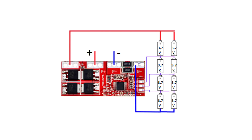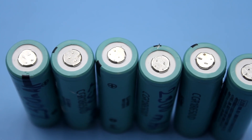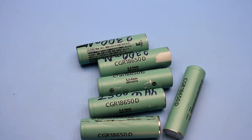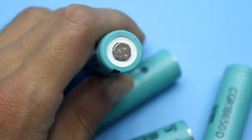In my case the battery is 14.8V, that is 4 cans connected in series. To increase the total capacity, parallel to each one another is connected. The cans were taken from an old laptop battery. I was lucky and cheaply bought a fully working battery which includes 8 cans. By the way, cans are some of the best kind — a Panasonic.